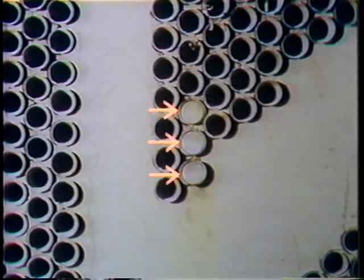Tubes are plugged like this instead of being repaired because it isn't possible to get into the tube bundle to all the places the tube might be leaking. In a minute we'll see how leaking tubes are plugged, but before we do, let's look at another way to look for tube leaks. This is a test that has to be done when the turbine is shut down. This way is more involved, but it allows you to find leaks you might not be able to detect with the vacuum test. Our second method uses a fluorescent dye to seek a leaking tube, and here's how it's done.